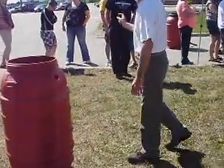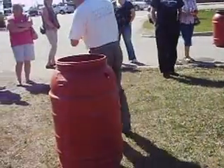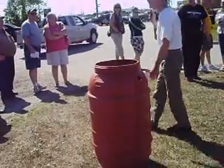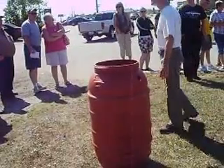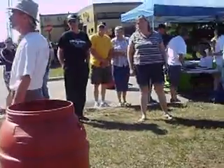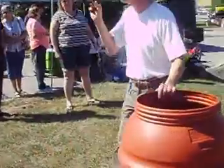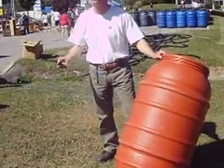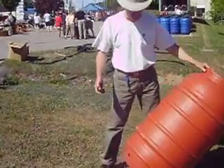Your barrel is made up of several parts. You're going to have your plastic fittings. If you ever do replace fittings on your barrels or make your own barrels, do not use brass. Rain water is naturally soft and will eat away the brass. You have to go with PVC or stainless steel fittings — obviously PVC, because stainless steel is expensive.